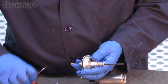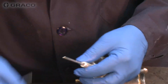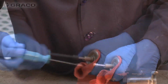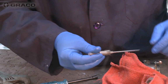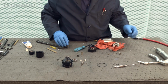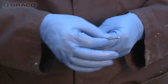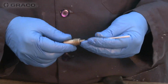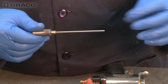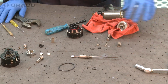We have the O-rings on the air piston. And there's a spring that holds the tension on the purge rod, and also an O-ring there. So we want to make sure that we replace this O-ring. It's also in the kit. Valve rod over there. We're going to make sure that valve rod is nice and clean and there's no burrs. We don't really want to use a razor blade on this because it'll tear up your mixed module and your packings. So we just want to soak that and clean it with maybe a really light Scotch-Brite, and we want to keep that nice and shiny and without nicks or burrs.